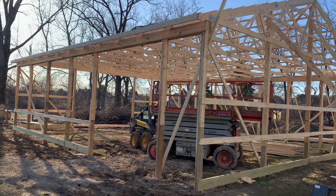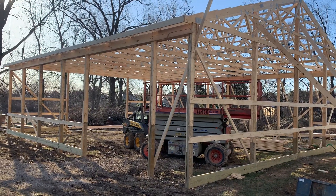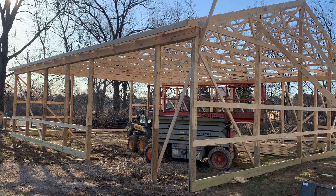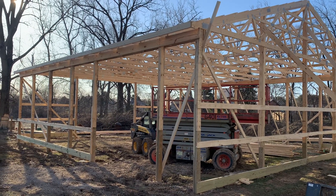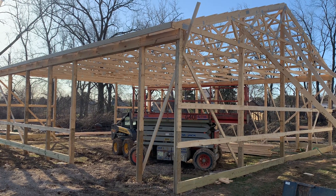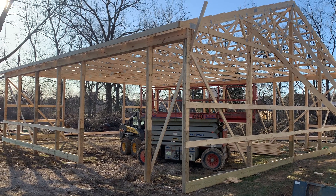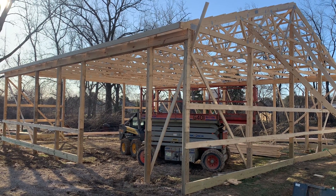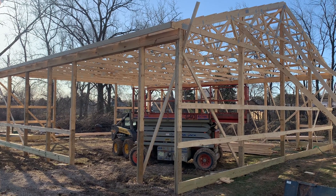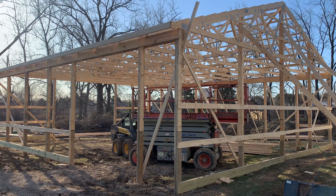Hey, Josh here out of Columbia Company, out here in Seneca County, Ohio. I want to make this video to tell you why we put our trusses four foot on center and we lay our purlins flat and not on edge — and give you an idea why we do that versus setting trusses eight, nine, ten, eleven, twelve foot on center. We manufacture our trusses right at our truss manufacturing plant at our home office, at our sister company.